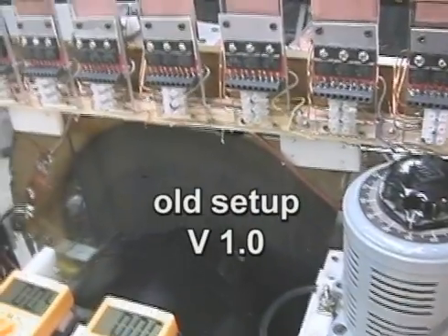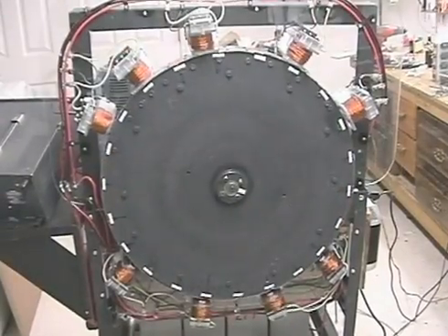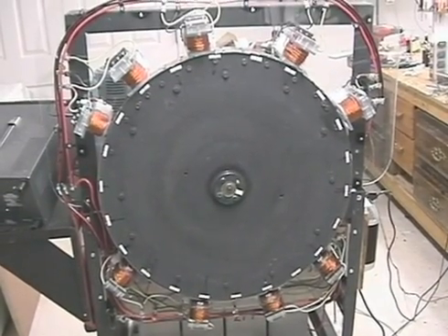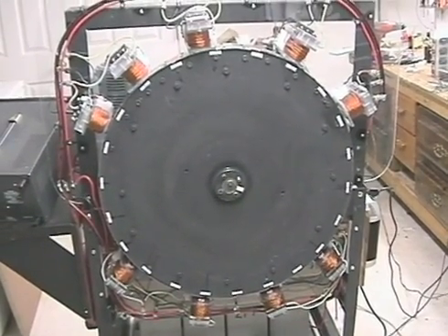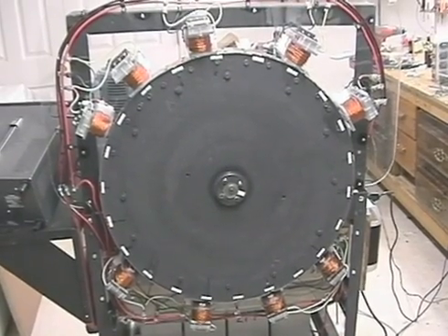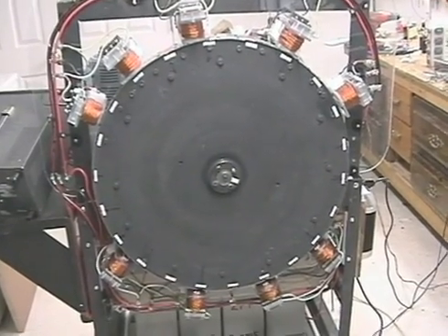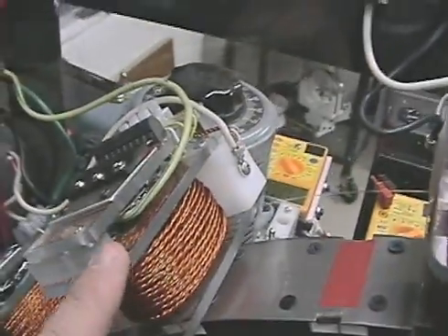As you can see across the top here, what I've done is take the coil control circuit and attach it to the back of the individual coil. Number 18 wire for the power. They're tri-filer power wires with a trigger wire, which actually makes them a quad-filer coil. But each coil has three power wires plus the trigger, and it's a non-centralized design now where each coil has its own circuit attached.